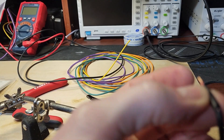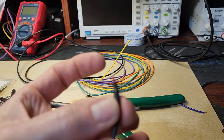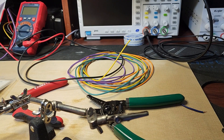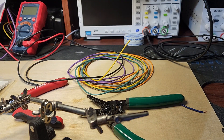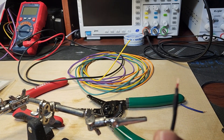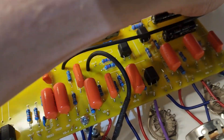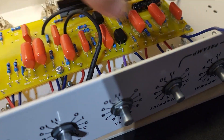Something went wrong - the wire is frayed. Turns out the alligator clip was so sharp it cut right through the wire when it clamped on. I don't have to scrap everything but I need to add another piece of shrink tubing. Be aware that alligator clips can actually be sharp enough to cut through wire, which could cause a short.